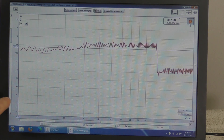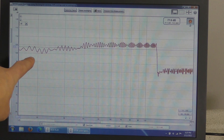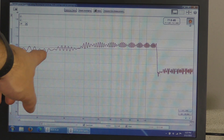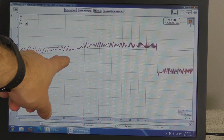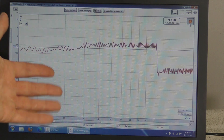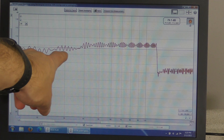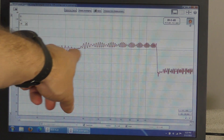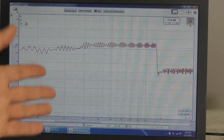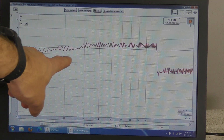There you go — it actually didn't fall off that far. We're talking about 103 compared to 107. This is probably going to pick up a lot of the mechanical noise more than the frequency response in terms of what you're seeing here. You can see the mechanical noise and then it picks up and it's a pretty flat response all the way through. So this should be a very musical sub — it's just a very linear response, and in-car we're going to see a bump on the bottom end here.